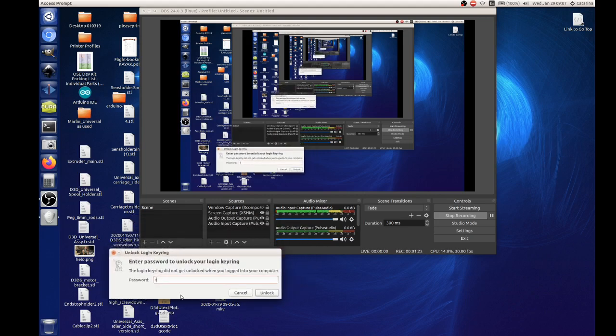So for today, we're going to do some power electronics, Arduino based. We can use either the Arduinos we made yesterday, or the Arduinos in our kits. We're going to get into controlling power elements using the Arduino, using rapid on-off fluctuation called pulse width modulation to control power that goes to devices. For example, we can control a light bulb using our Arduino. We can control a big motor or even a welder. With the welder, we're going to get into battery packs and a very simple welder prototype in the afternoon.